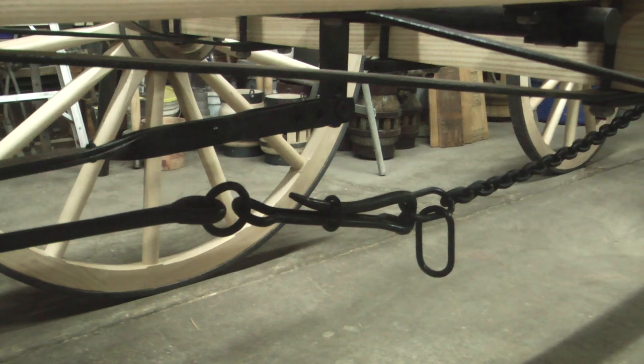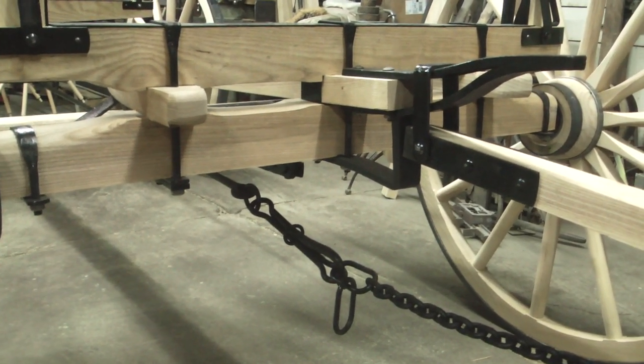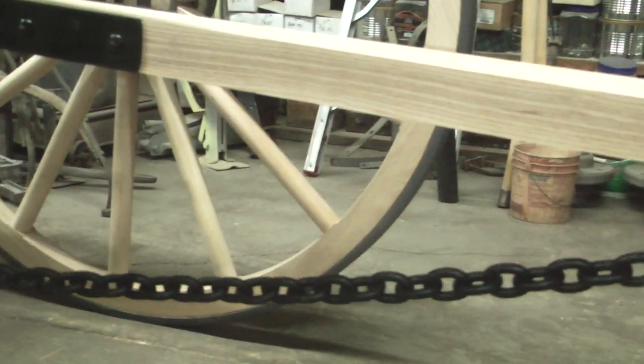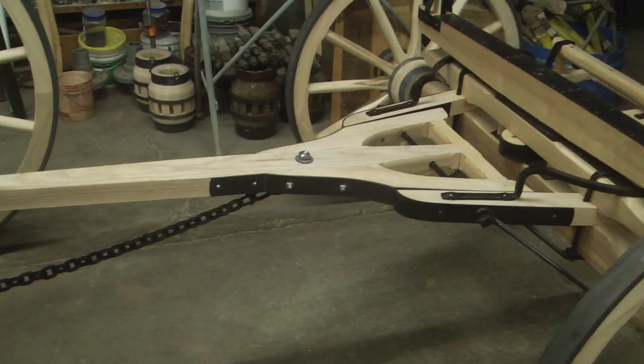The Pelican hook is attached by two large rings to the next chain to the second wagon. The second wagon hooks to the horn and bumper with a clevis and a butt plate. This goes back to, in this case, where the double tree would have been on the second wagon, and pulls the second wagon.